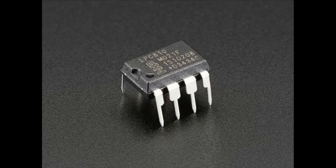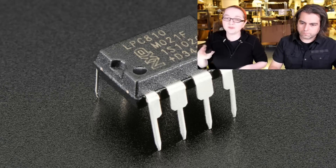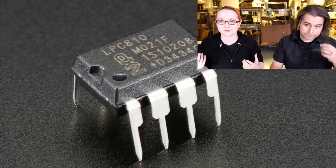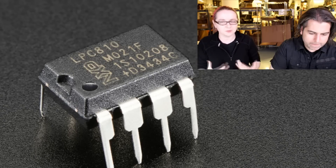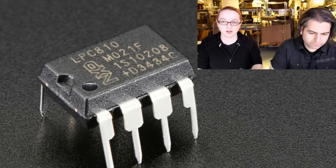Let's do this. First up — I've got a lot of demos, so I'm going to set up. What's this cute chip? I'm going to move this over. This is — it actually looks like just an LPC-810, but it's so much more than that. It's actually a DSP chip. It's an LPC-810, which is a Cortex M0 8-pin DIP, which is pretty amazing. It can run at like 72 megahertz or something ridiculous, but it's programmed to be like a full synthesizer that takes MIDI in and then does high-speed — it doesn't have an analog output, I don't believe it has a DAC output. I think it just PWMs really, really fast, but it's good enough to do audio synthesis.